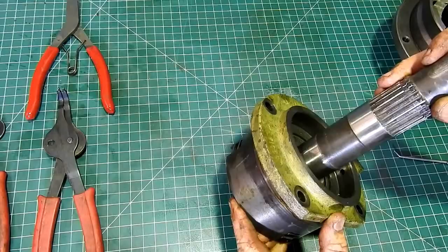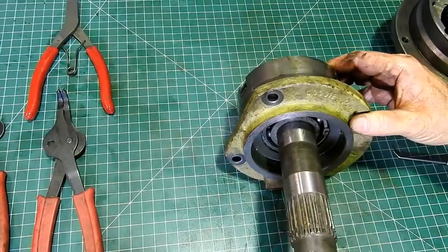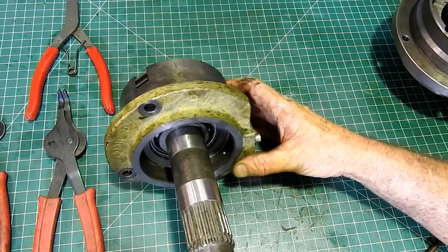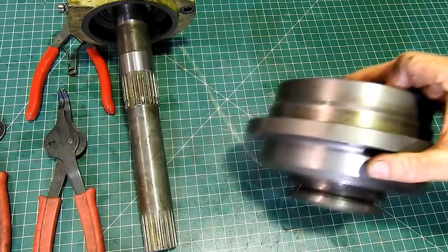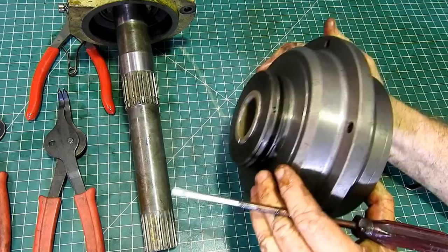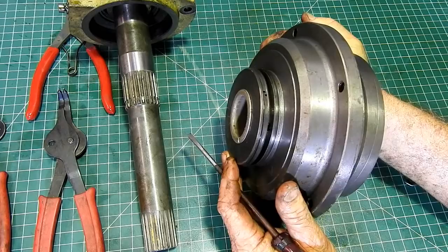If I can show you just in there — you can just see the hole there in the shadow. Maybe we can roll it around so you can get a better view — you can just see the shine of it. And that lines up directly with this port here, so the oil comes in this port, comes into the system between these two sealing rings. You can see a drilling, and that drilling goes into the clutch pack.